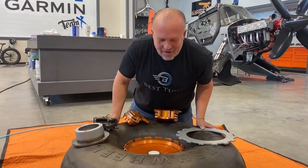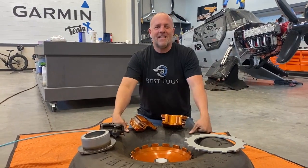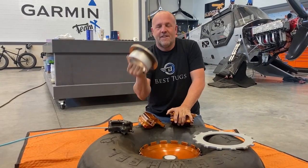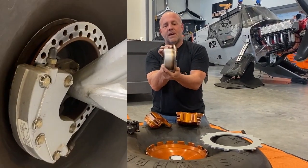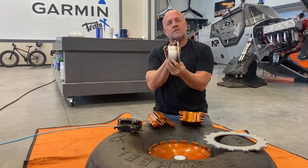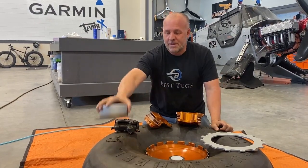All right, so I'm pairing up two of my favorite aviation companies together, putting my Alaska Bushwheels and a Beringer wheel and brake assembly together. Typically, a Cub would have a disc about this size. This is actually a heavier duty one. I was hoping that this would handle the horsepower of Scrappy and the quick stopping I want to be able to do. Close, but at about 75% power it started to roll. So I needed to go something bigger.